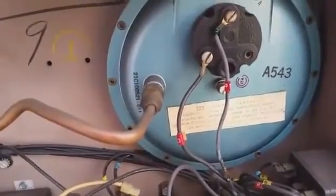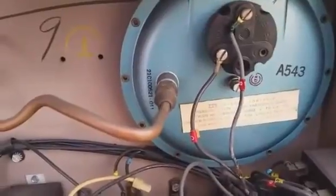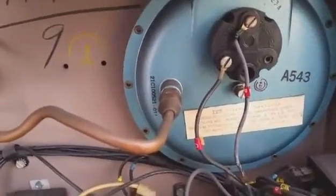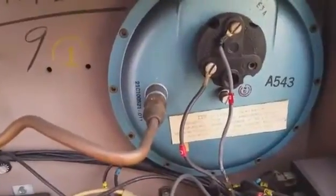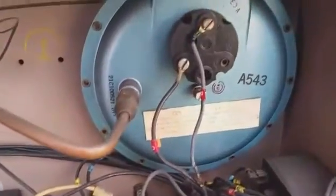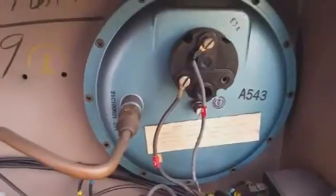Like you guys would, I look at the diagram and figure out what these controls are, because a lot of times something like this you don't see every day, and I would have no idea otherwise. I know it's hooked up to the outdoor fan motor to sense pressure once it was running, but once that static pressure increases because there is ice on the coil, it will cause this switch to trigger. So we're going to see if this switch closes like it should — let it get some ice on it and see how it works if we cover up the outdoor coil.